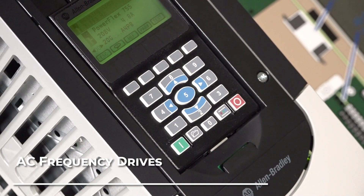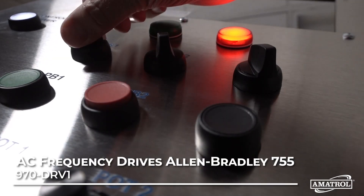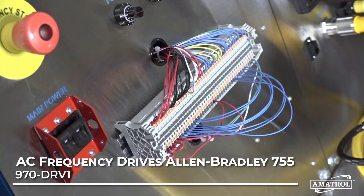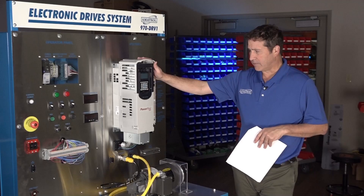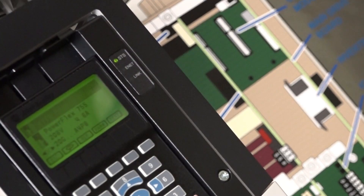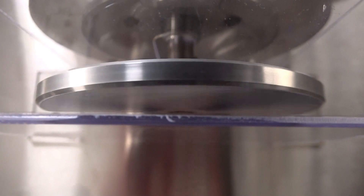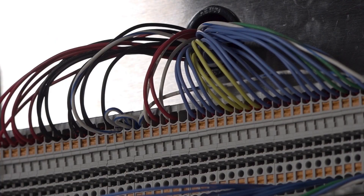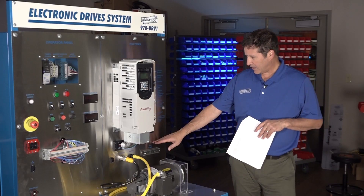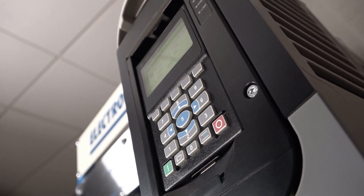On the hardware side, we have an operator panel with controls and a terminal block for hand wiring of different configurations. The frequency drive itself — the 755 drive — we have a printout of the internal components of the frequency drive, and then on the workstation here: encoder, motor, and flywheel. We also have on the high voltage side test points with guarding, so we don't have to get into the drive itself for fault detection.